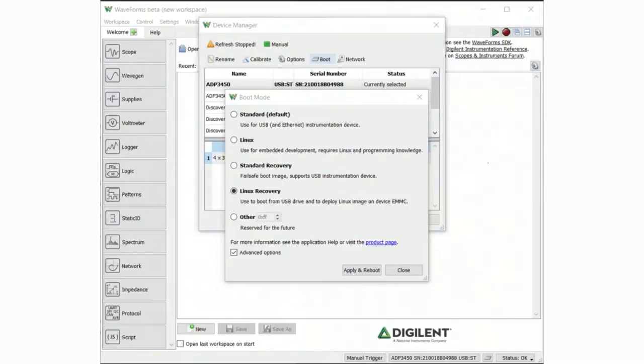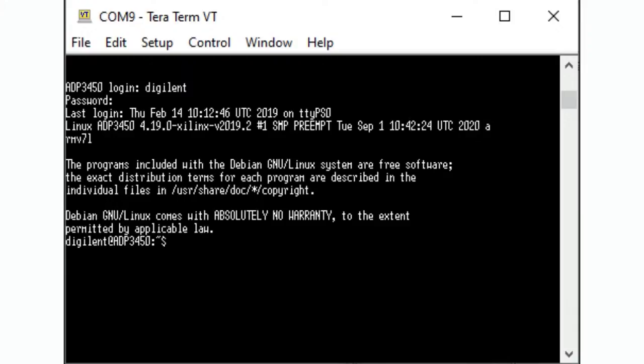Here's another thing that I thought was really interesting. Anytime you see something with four USB ports and Ethernet, you know that's not a microcontroller — that's running embedded Linux, right? Because your microcontroller is not going to be able to do USB host. And in fact, it is running embedded Linux — it's got an ARM core inside. What's interesting is that you can log into it as a Linux computer, and they really lean into that. You can run software on it natively so you don't have to worry about the bandwidth issues of trying to stream very fast data over USB and Ethernet. You can plug in a USB data stick and do massive data capture with higher throughput and lower latency.